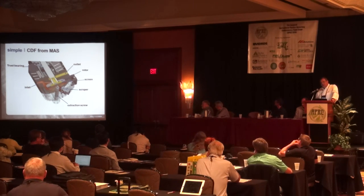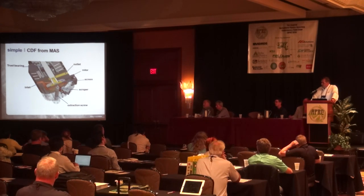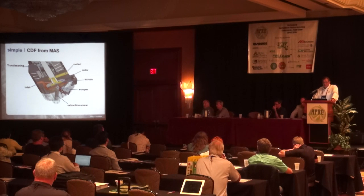so you have a continuous flow coming out of this machine. The huge advantage of this technology is that you can run multiple hundred tons of material through the screen before you have to change it. The screen itself, since it's a steel plate, can be recleaned numerous times and reused. So you look at 400, 500, 600 tons of material that can run through one screen. Always depending on the material, of course, and the contamination level.